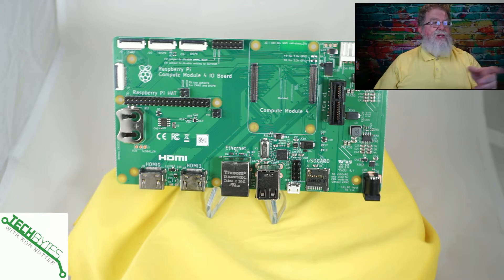If you look to the right side of the card, that's the 12-volt power connector — and yes, I did say 12 volts, because this board is going to need that kind of power. Just to the left, that's where your microSD card will go in. Since I've got the lite versions, this is where you stick your microSD card with all the boot code. If you notice that little black connector just to the right where it says Compute Module 4, that is a PCI Express connector. You can use expansion cards, and this gives the CM4 a whole level of expandability that lets you take your Raspberry Pi work to the next level.